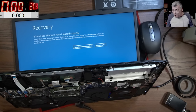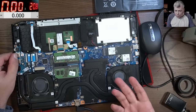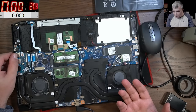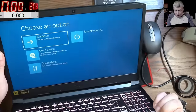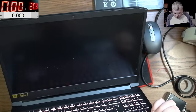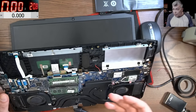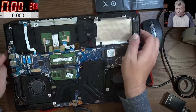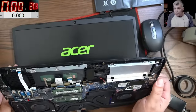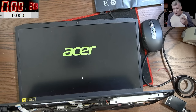Actually you don't need a power button anymore! So let me get this straight: closing the lid is like keeping the power button pressed. But wait — you can set up in Windows what the power button does. You can set the power button to do nothing, and that's the right setting. When you close the lid the computer goes to sleep; when you open the lid it comes to life.